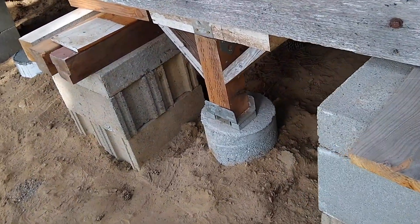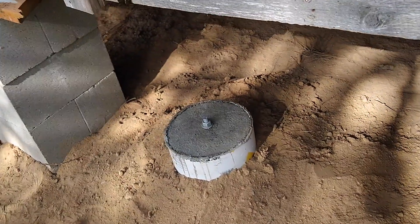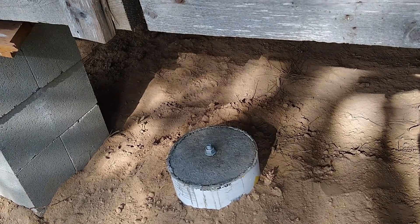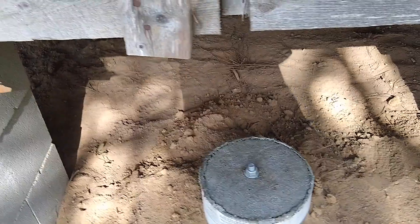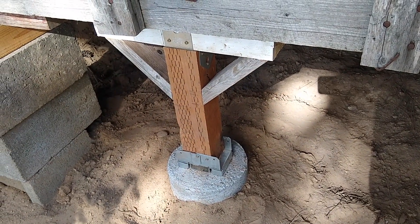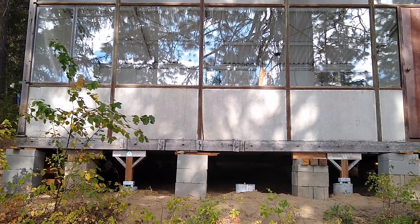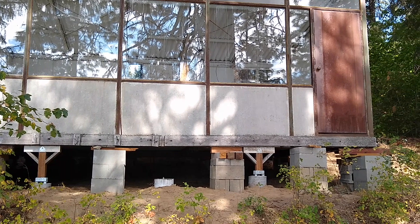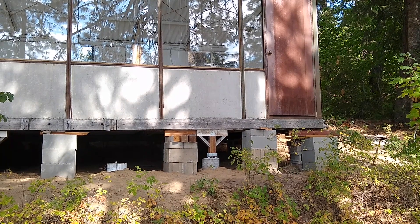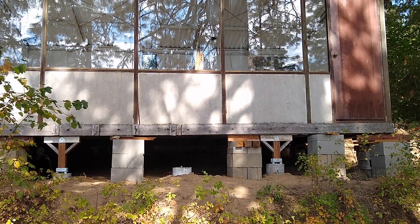You can see there's another pier now able to hold weight. A new pier was dug and filled with cement, ready to go right in the middle of the front of the cabin. Here's another view from the front of Tall Pine Cabin showing the piers in place holding weight. Those 4x4s are temporary until we get the final leveling done, and then I'll put some 6x6s in there to hold the cabin up and keep it tall.